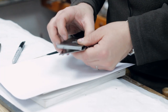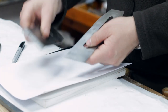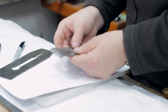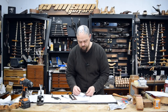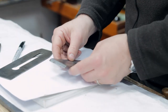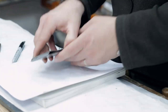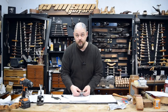So you have several things you can do. First of all, you need to know that the blade itself is actually flat and square, which is rather important. And then you need to make sure that this bent bit of the chip breaker is evenly bent and therefore flat. And once it's flat, you put it on the blade and bolt it down and then it does its job.